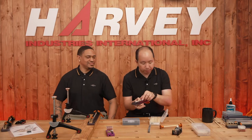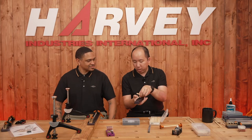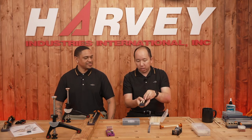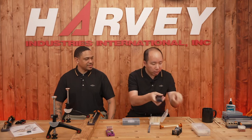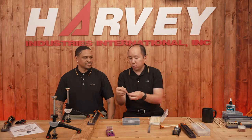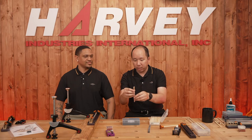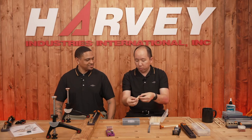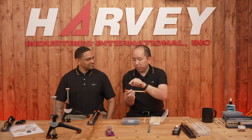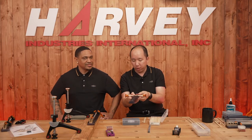Once you cut that out, you'll set these two inside, like so, at an angle, and profile it down to a hexagon. It should at some point look like so. You'll have two pieces that are cut into a hex if you put them together. Apply some glue, put the lead inside, and glue it up. Clamp it down. Put this on either end to hold it in place, and use this to clamp and hold the middle section. Allow that to dry.